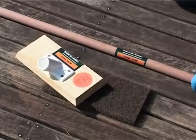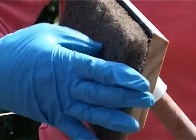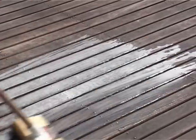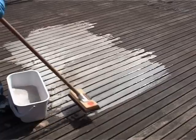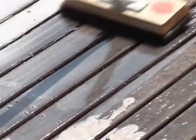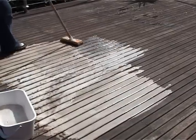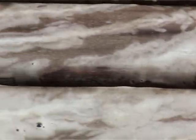Connect your Easy Mop and press your Easy Mop applicator firmly onto the end. Dip the Easy Mop into the solution and begin working it into the deck. There is no need to scrub too firmly at this point, as you need to allow the cleaner to bring the impurities out of the surface. Once you have covered the area, leave to stand for around 10 to 15 minutes to allow the solution to activate.